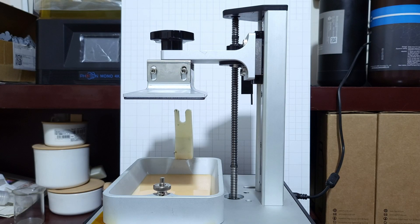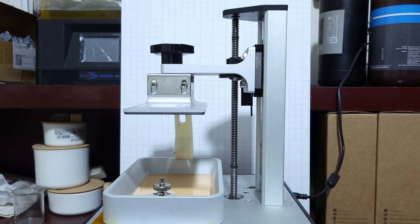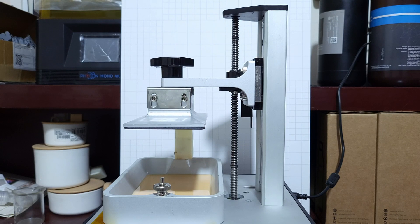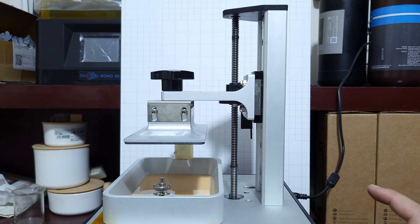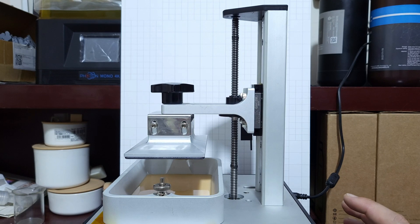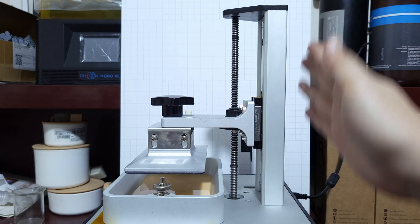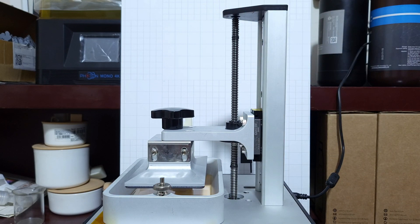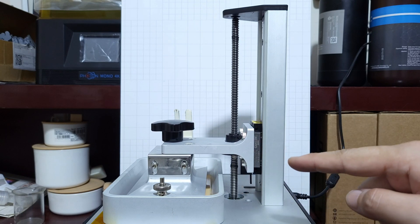I have finished assembling the upgrade kit with the damper. The purpose of this upgrade kit is: one, to get rid of wobble lines, and two, to get rid of build arm or T-plate flexing. Back when this upgrade kit first came out, I read in a Facebook group that some people complained the T-plate or build arm no longer flexes, but the flexing is transferred to the Z-tower, causing it to lean during lifting, especially on bottom layers where the peeling force is the highest.